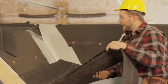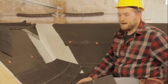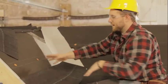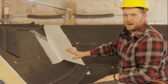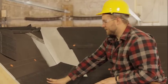So what I like to do is basically a reverse stairs. If you remember when we started shingling over here, we had a long part on the bottom, then kept going gradually shorter and shorter so we could work with 4 rows or 5 rows at a time. Basically I'm gonna do the same thing, except I'm gonna start with a short row and keep getting longer because we're working up our valley. So first shingle's installed.